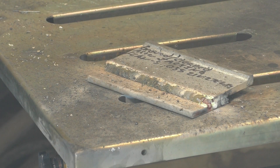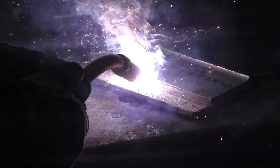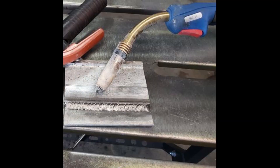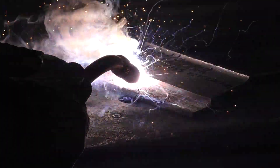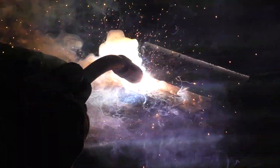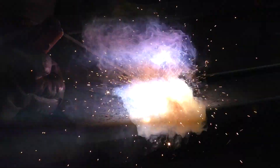After finishing this last test, I felt like I cheated on the self-shielded flux core coupon, so I decided to do another test run on fully galvanized steel like the others - and it welded identical to the last coupon. It looks a little bit different because I tried to get high speed, low drag and added some gun manipulation to widen the weld, but other than that it's identical. If I had to use a MIG gun to weld a similar joint, I would definitely throw some self-shielded flux core wire in there. And if I had to stick weld it, I would probably use 6010 as a first pass, then 7018 the rest.